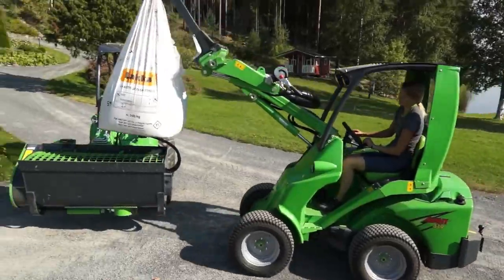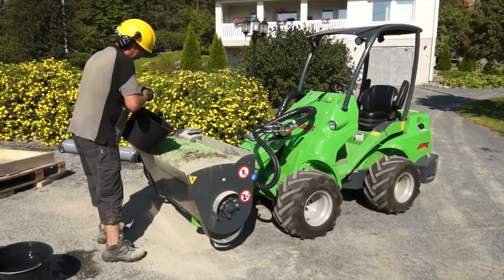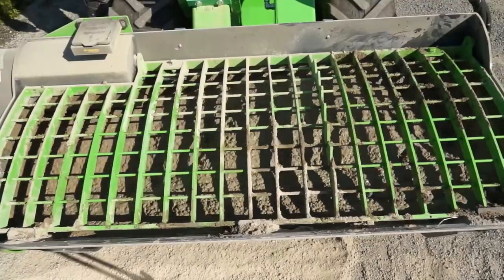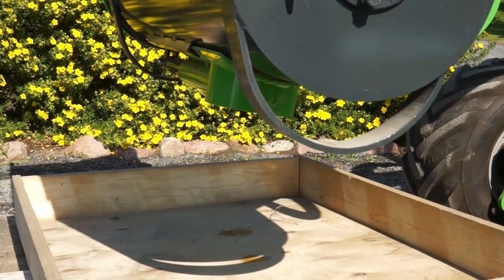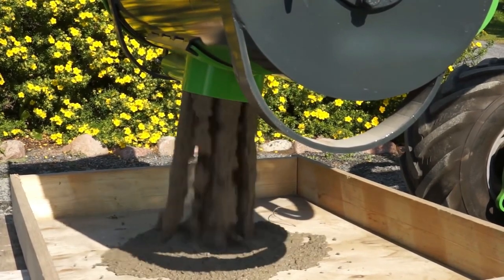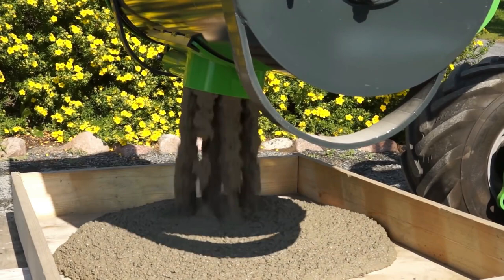The new model is equipped with a 400-millimeter screw shaft and a guard grill on the bucket. The bucket is emptied from the bottom hatch in the middle — hatch opening is powered by a hydraulic cylinder, controlled with an electric directional valve, operable from the driver's seat with an electric switch. The bucket is also equipped with a flexible emptying tool which mounts on the bottom hatch, enabling the pouring of concrete further away from the bucket.